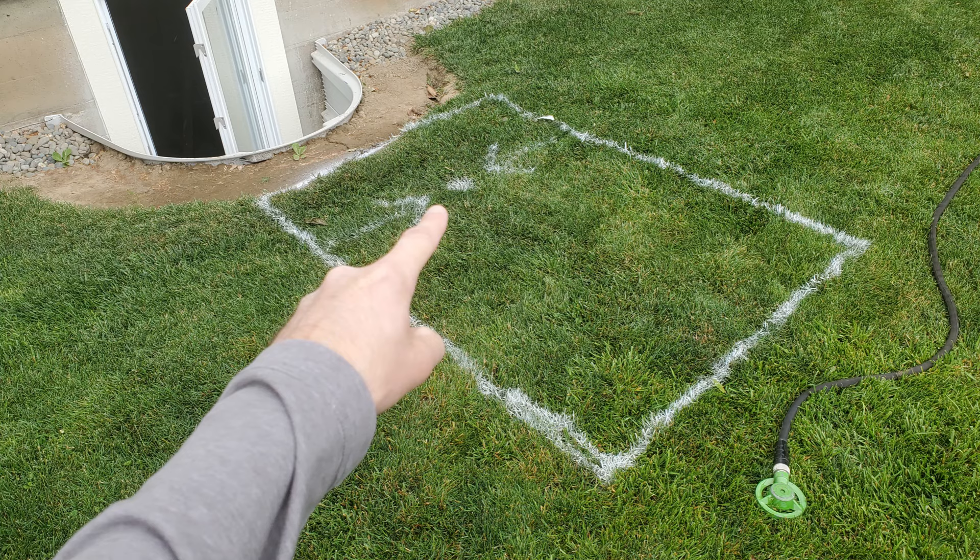They said the roots were about six to seven feet down. I told them I want to get that section of pipe replaced, have an outdoor clean out put in since I didn't have one, and a backflow preventer valve put in as well — so if the sewer down the street ever plugs up it doesn't flood my basement. To save some money I said I'd dig it out myself; they just had to come replace the pipe and put that stuff in.